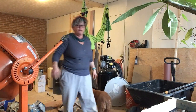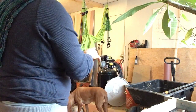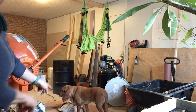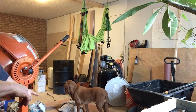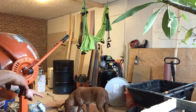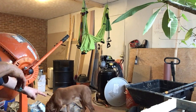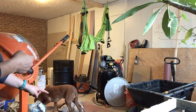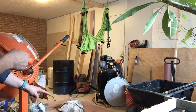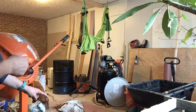Next up, we'll be building the form for the heat riser. We've got an aircrete one already started. That's what's in that container, right where my finger is across the room. That is aircrete and perlite. I'm waiting for the sodium silicate to seal that aircrete. It's probably only going to get maybe 100 degrees, so it doesn't really need it, but I want to test it on a small piece.